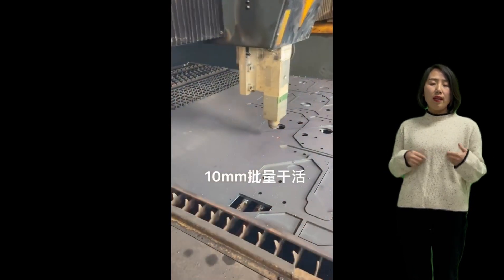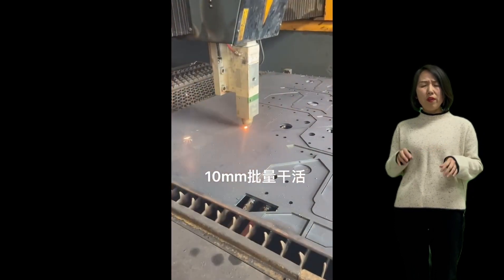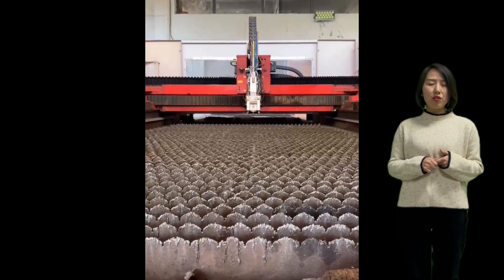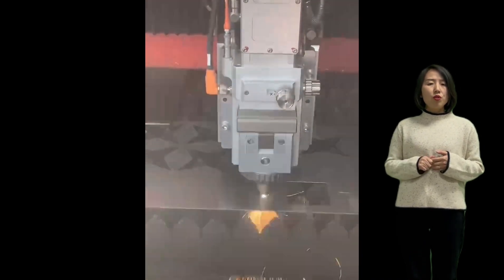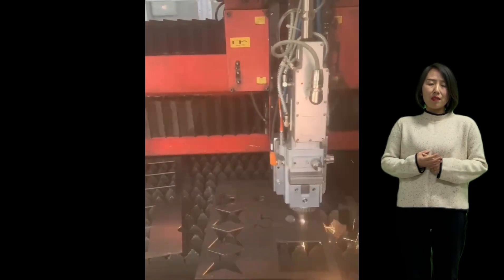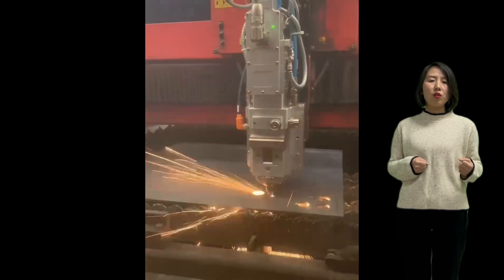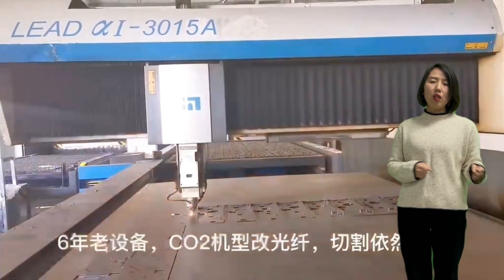These machines are like 20 tons in weight and they move really fast. Even with 10 years of running, they keep fairly good accuracy and dynamics. So even today, comparing these old machines with new machines from Jinan or other cities, or smaller manufacturers in China — I think the CO2 lasers still have better quality compared with them. It's just because they run on CO2, they consume mixed gas and have high electricity consumption, which makes this cutting technology less competitive. But that doesn't mean the machine is not good. So what we can do is retrofit them into fiber.